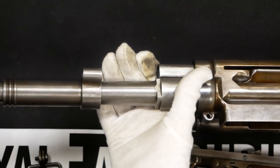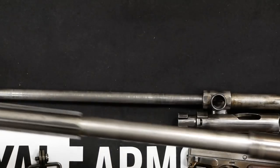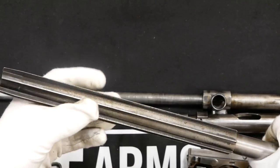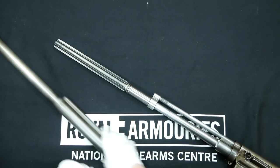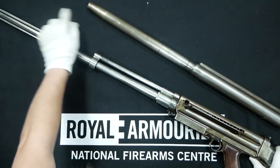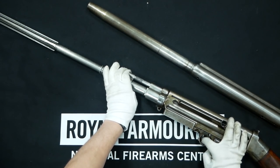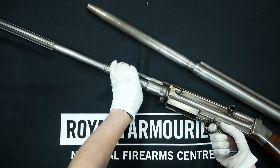Looking at the piston now — it's screwed onto a groove that can rotate back and forth, located before cooling fins on the barrel. These fins were probably designed to keep the barrel shroud away from the barrel during high rates of fire. The shroud slides off and is pinned to the rifle. The entire piston system goes back and forth during operation, very similar to a pistol Lewis also designed at the same time to compete with the 1911. It is an open bolt weapon system, which was probably necessary for high rates of fire to prevent a cook-off in the chamber.